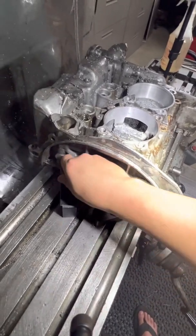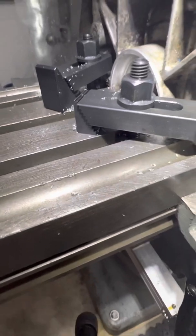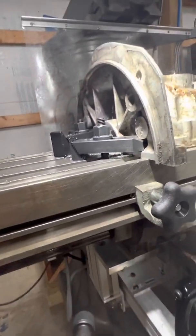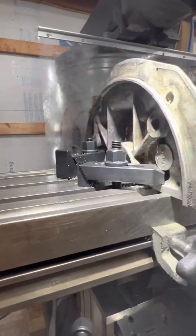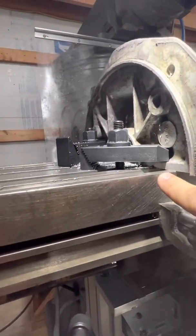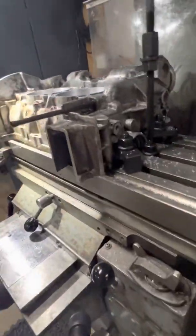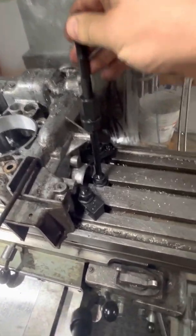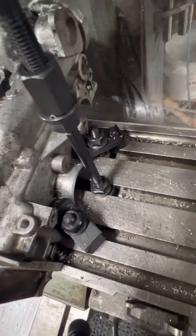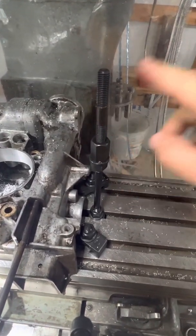You don't have to kill these when you tighten them up. I like to get them about as even as I can — they're just on these little step blocks, and I just toe clamped right over top of a bolt hole. Same again on this side. This I put here — this is just a T-slot and some studs, and I'll show you what I'm going to use this for in a second.